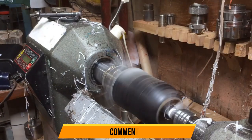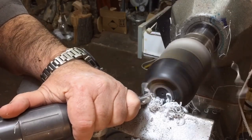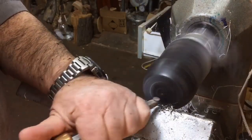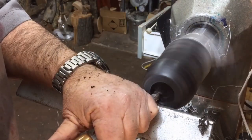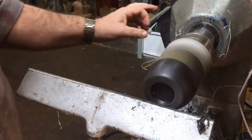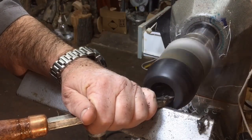Don't forget to comment at the bottom — it's very important to me. And if you like this video, don't forget to subscribe and like it. In the foot of the coffee mug, I'm creating a recess that I'm going to use to hold the whole project when I turn it around. Here you can see I'm using the small carbide from Easy Tools, then I'm going to reverse direction and use a diamond shape to cut in so it will be reinforced where I'm going to hold the chuck.